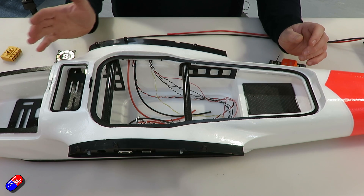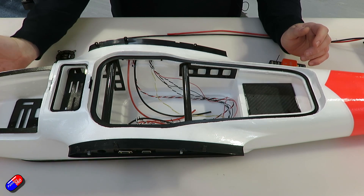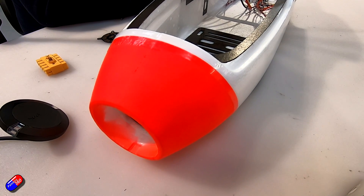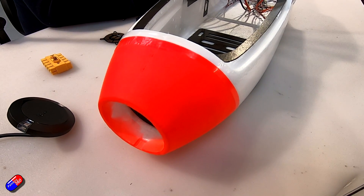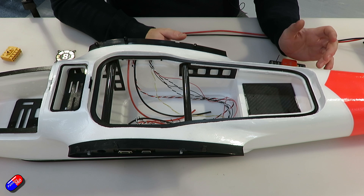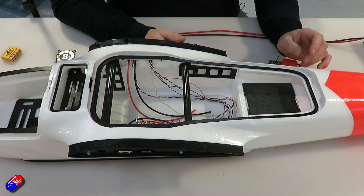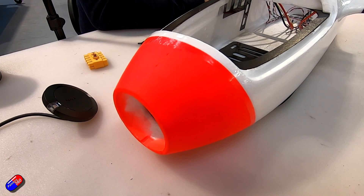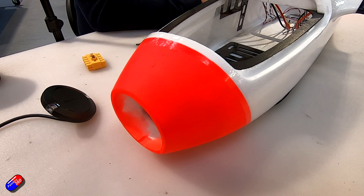We do avoid some of the really tight curves, so in this case the laminate stopped proud of the nose, because if you try to cover every bit it often gets wrinkly or messy and then peels away easily. The fluorescent paint is plastic dip — we buy it in an aerosol. This colour is blaze red. When applying it, you use the white plastic dip underneath first, then a few coats of the fluorescent, and that gives a good finish. For a training aircraft we want it highly visible, so we do the tips, body tips, and tail tips.